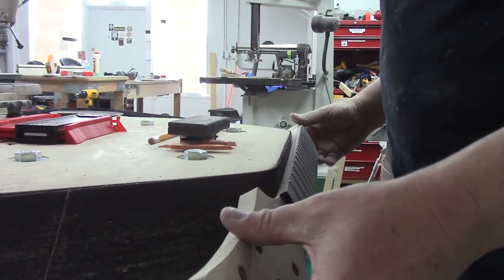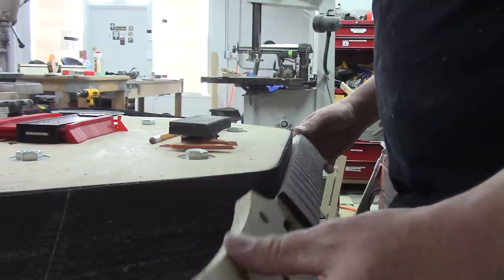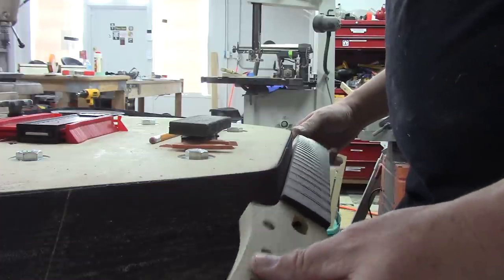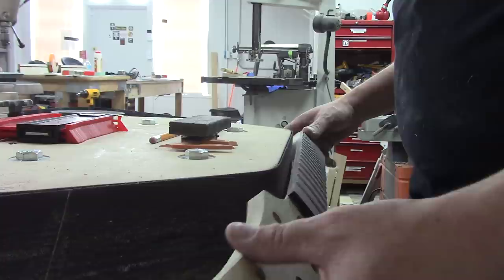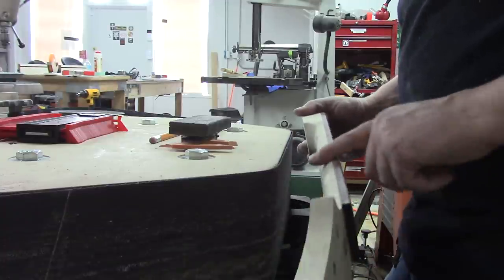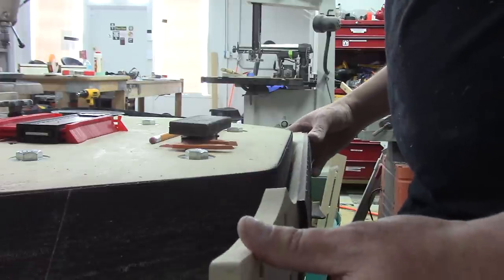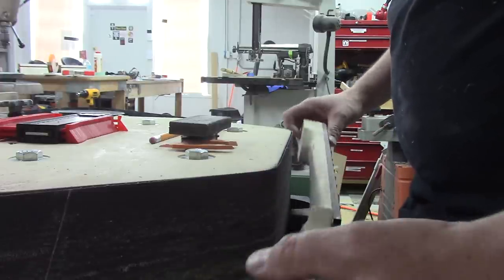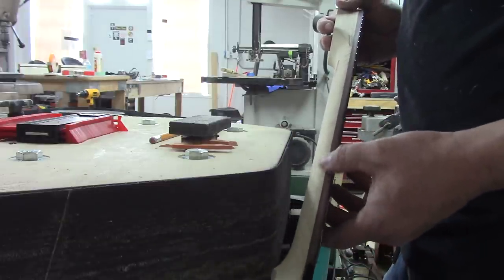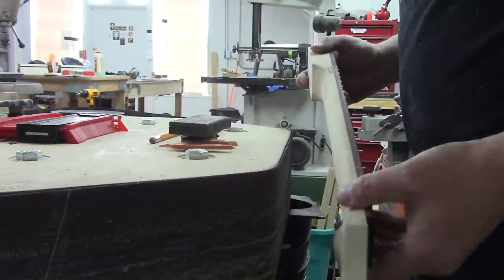As I was telling you, I wait to break that edge off the fretboard until the last part of the actual shaping is done. What I don't want is any weird grooves or to sand too much in one spot. So just keep the thing moving, and save breaking that edge off until last or pretty close to last anyway — and that is a good thing.